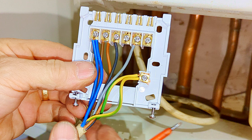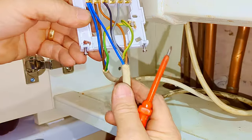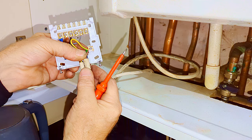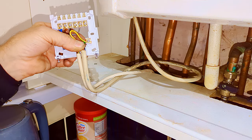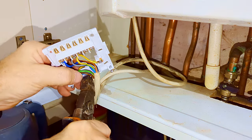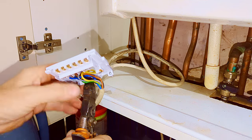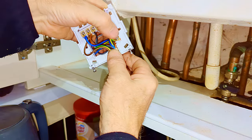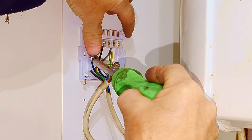Something I'm a little bit annoyed with myself about — I've left these wires a little bit long. I should have cut them back much shorter, so if left like this the wires are going to be hanging out of the bottom of the receiver unit and that's not really acceptable. But if I just curl the wires up a little bit inside, then I can cut the little plastic piece on the bottom which clamps the wires — that'll hold it in place and that'll be perfectly okay. So I'll use my side cutters and carefully cut that bit of plastic, then carefully break it out.